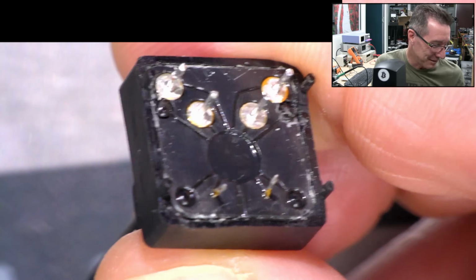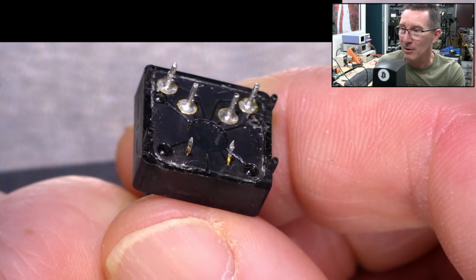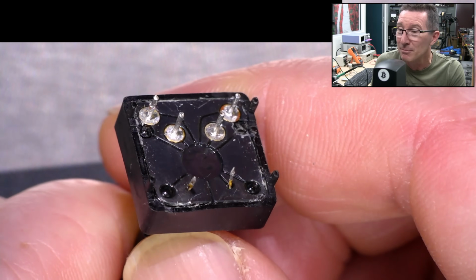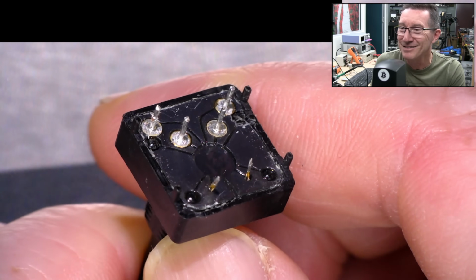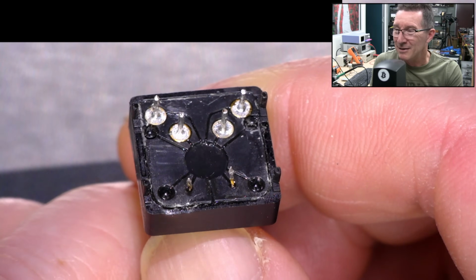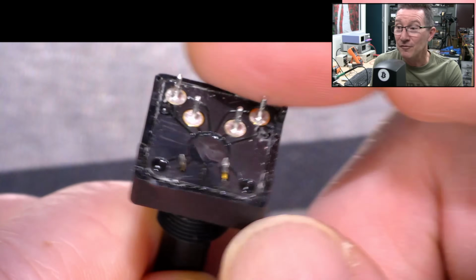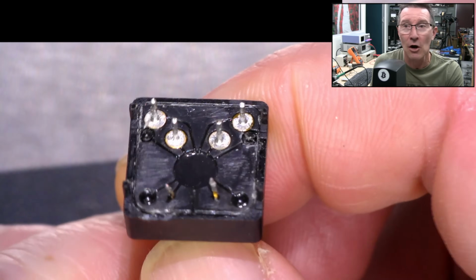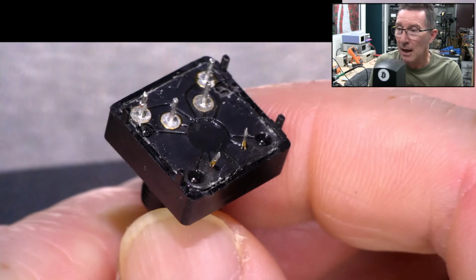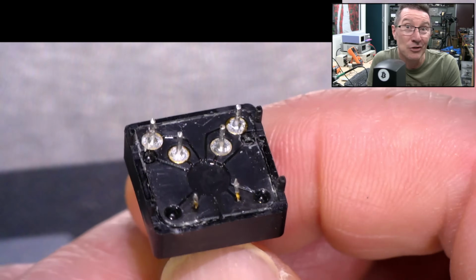So please leave it in the comments down below if there's a modern one, or even if you can get the original, even if you can't buy it anymore, I might be able to take apart an old product. Obviously I can't get another Haefely, I might have to contact them. Maybe they've got a spare switch kicking around somewhere. Anyway, if nobody can identify this, the next step is I'm going to have to get medieval on its ass. Before I do, I don't want to destroy it. I will have to re-hook it up to a circuit and a multi-channel scope and measure it and get the profile of how it encodes in there. Then see if we can find an equivalent modern replacement and bodge it in somehow.